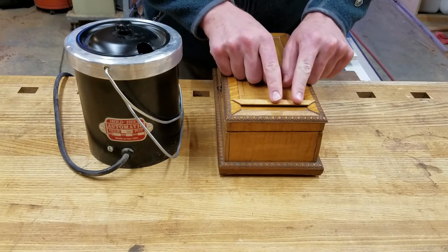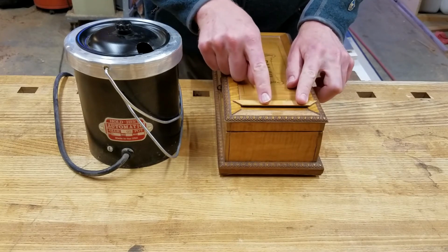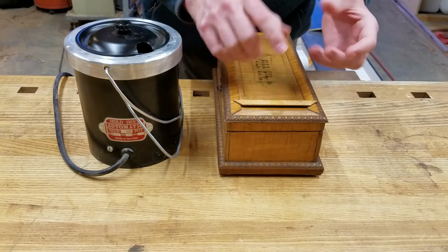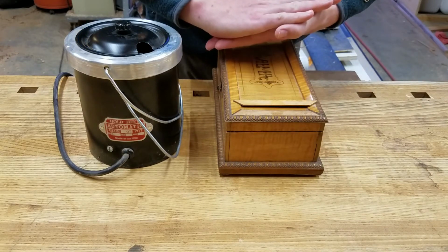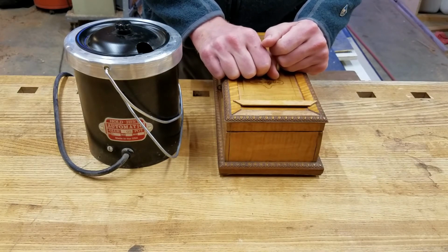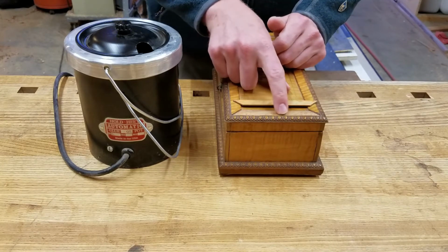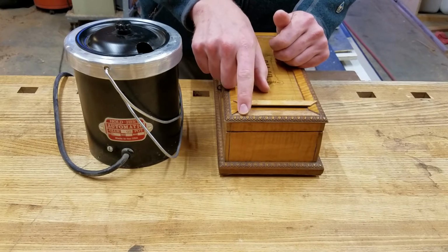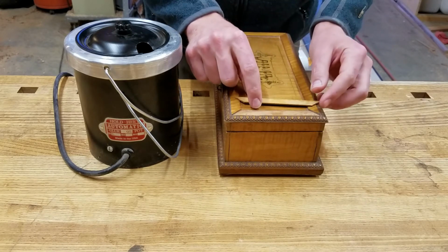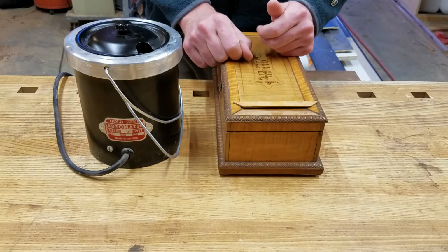So this is that place where hide glue works by a mechanical bond. It will adhere to the texture of these surfaces and then create a bond between them, just with traditional adhesion. And that's going to allow us to, even if this surface were compromised, if this were not perfectly porous anymore, it would still bind. And because this is old hide glue, this fresh hide glue is just going to melt that and rejoin it all together.